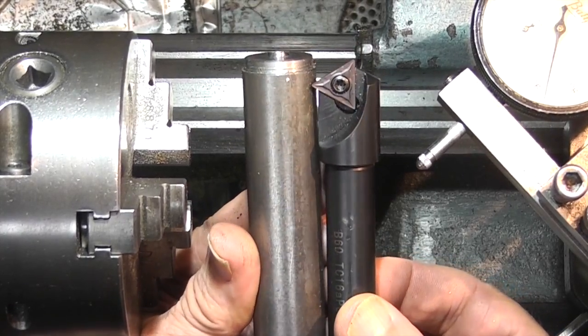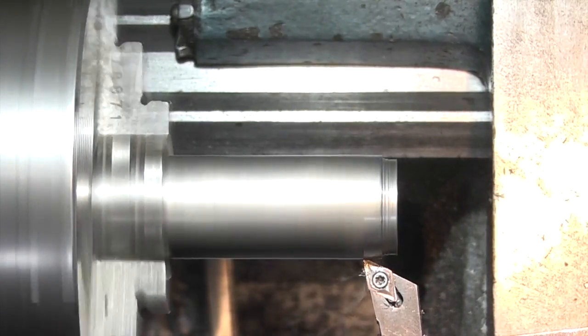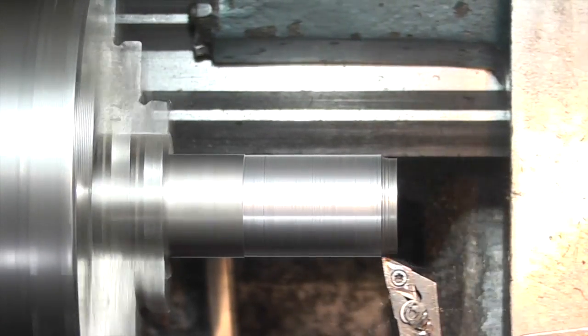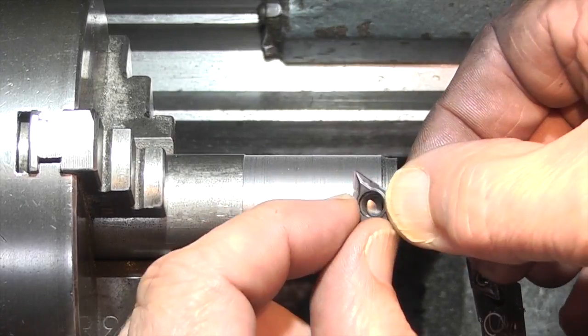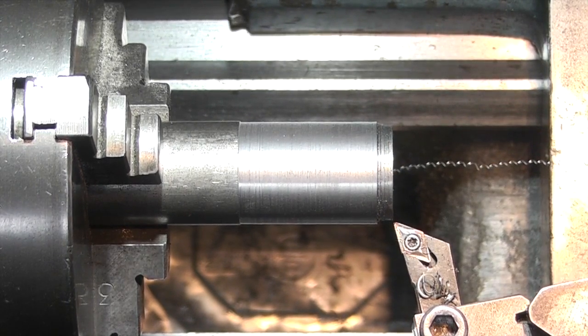There's the original tool and you can see I should be able to get another tool out of this. What I want to do on this end is put a 45 degree angle on the end so that when I machine it the tip has the angle already there to follow, and that will guide me on the pocket I need to cut for the tip. I've changed my compound slide to 45, re-adjusted the tool in the tool post so it's at the right angle, and now I just want to put a 45 degree point on the end of this bar.